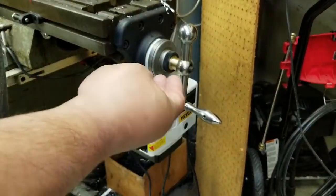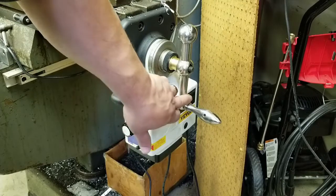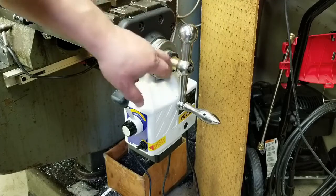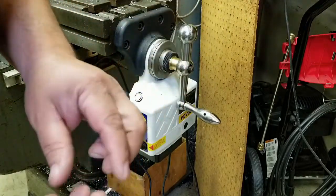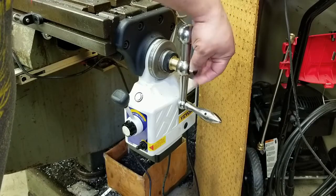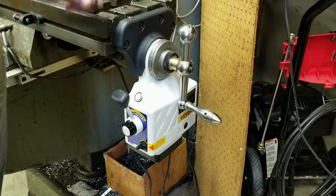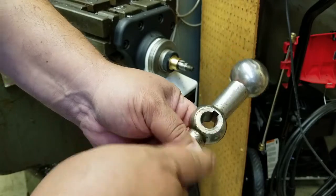To be fair, it's not even completely finished installed yet. You can see how close we are to the handle of my mill hitting the housing. I was going to take off this bushing here on the lathe, but if I did that I wouldn't be able to use the handle — my handles are apparently bigger than a Bridgeport's. So it has to stay as-is, and consequently the nut doesn't thread all the way on enough to lock it down. I'll need to use some Loctite or possibly drill and put a soft shear pin in there. That's the initial problem — the keyway is very large.